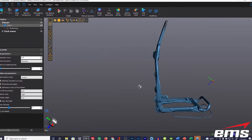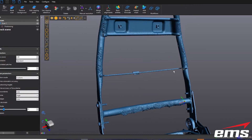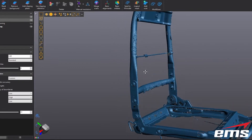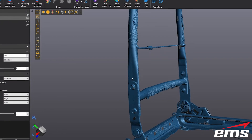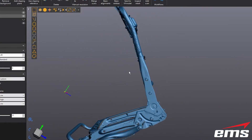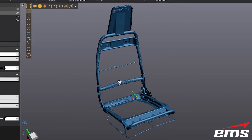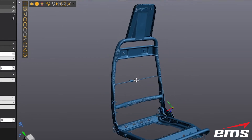Taking a quick look at the scan data — you can see it looks really good. We were able to get all the way around the part, even on this thin wire rod here. All the rough stuff was the foam on the frame that was stuck to it. But if you look closely where we wrapped the Speed Target tape, you don't see anywhere where the tape was put on. If it's sitting on a surface, you really don't notice it. So we were able to scan this pretty tricky shape with all these big openings by using traditional targets, the turntable, and the Speed Target system to get a quick scan of this seat frame.